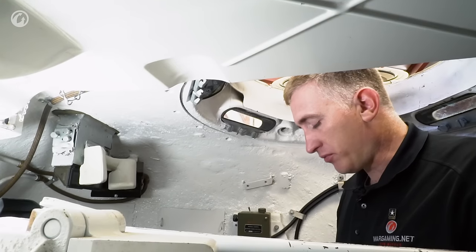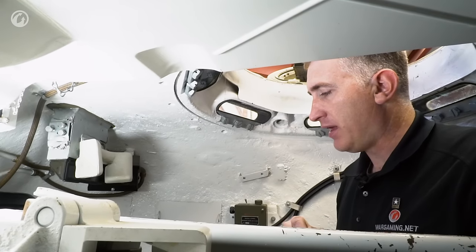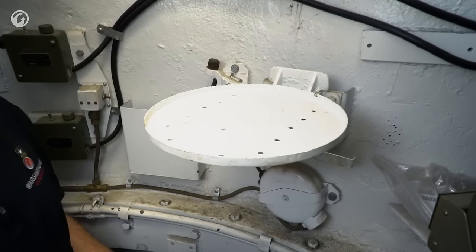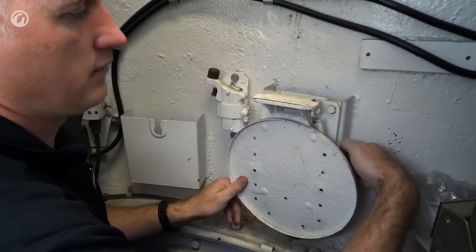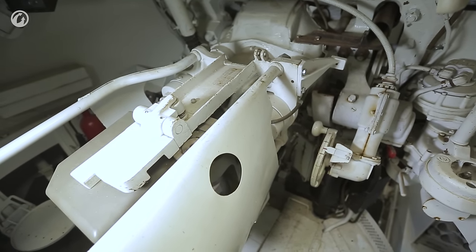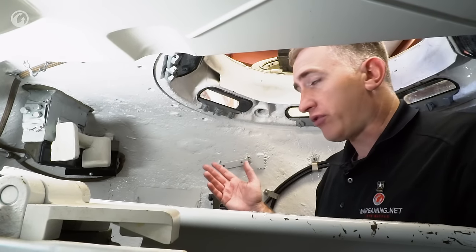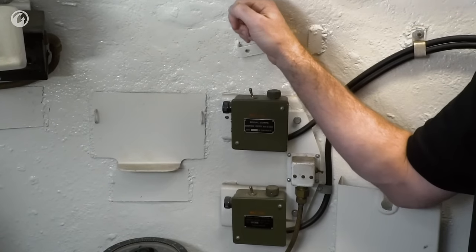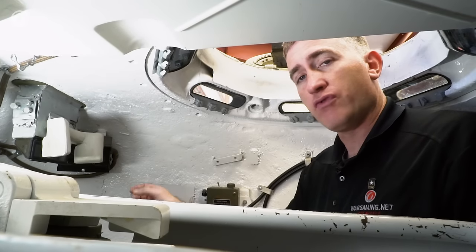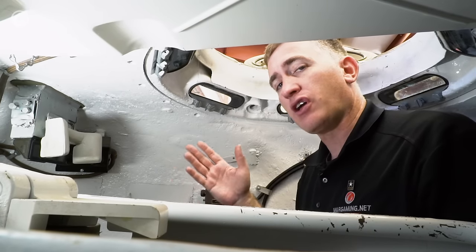Now inside where the commander will be seated — I'm on a fold-down seat, a very simple lift-latch fold-down. If I wanted to be seated with my head out there is an additional platform here. It is cozy in here. The breech recoil guard is taking up a lot of my space, and I've had to place one leg on either side of the gunner's seat. Controls going around: he has an override handle here — push forward for left, back for right — and this is simply a physical cable that goes all the way down and moves the gunner's control handle, which then moves the rest of the system. Very useful for getting a gunner onto target quickly.